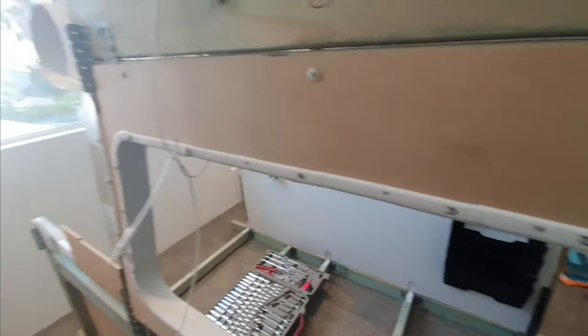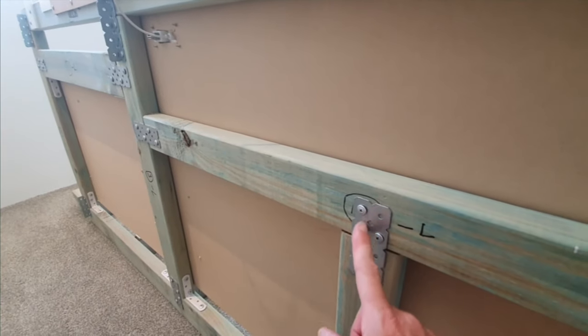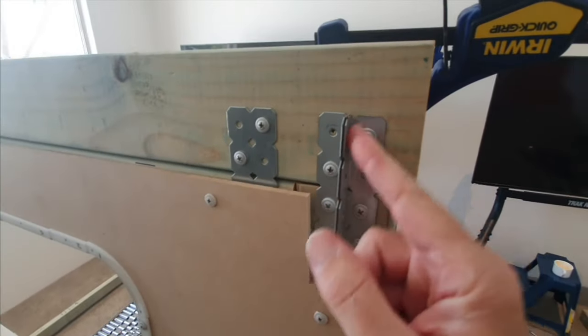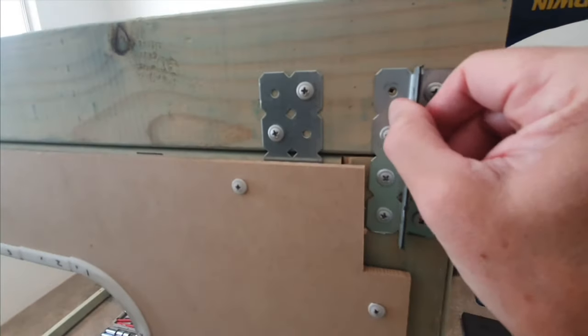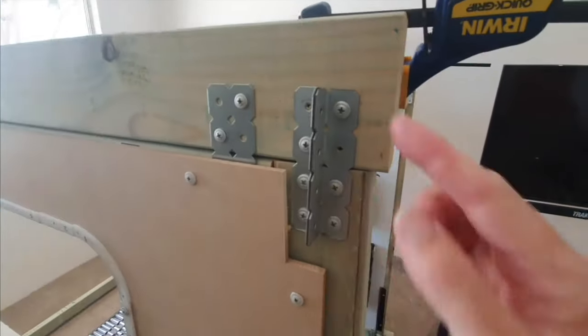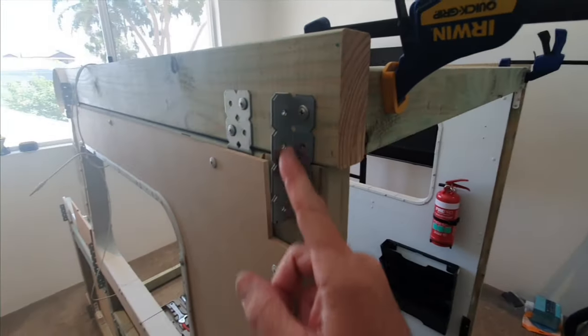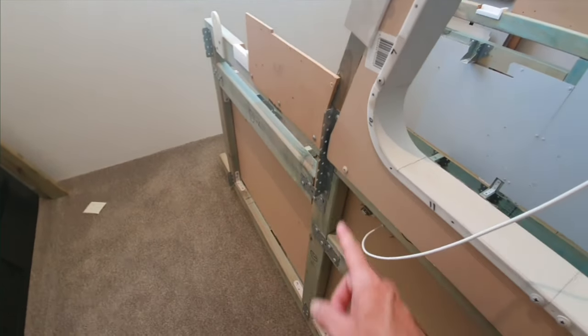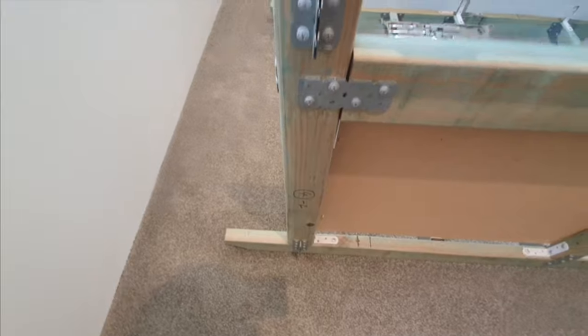Similarly, just to give rigidity — because flat plates hold things together but lack rigidity and can flex — you generally want a T-section. You can actually get these brackets in angles, so what I did is put two of them back to back and sandwich them together to create a T-section. That gives you rigidity in that direction so it won't bend. I've used that back-to-back trick throughout quite a bit of the outside and towards the front as well, which was very useful.